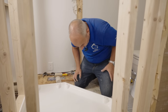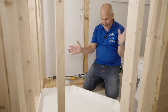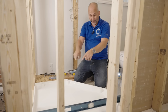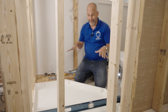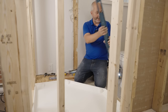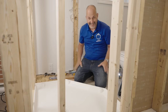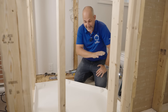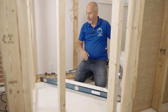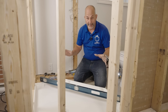There are two reasons why we want this perfectly level. One is the door kit will install so much easier — we're talking about glass panels and prefab everything, no tile. Number two, this pan is designed to move water to the middle of that drain from all four corners, but it only works if installed level. If you're out one degree, you're going to have pools of water and staining in your shower pan. Now it's installed — do not touch it. Leave your level on here so everybody knows it's okay, and don't let anybody touch this until the next day.